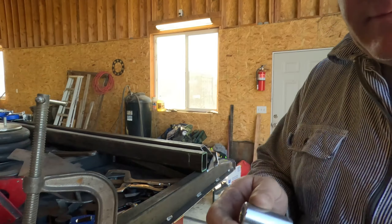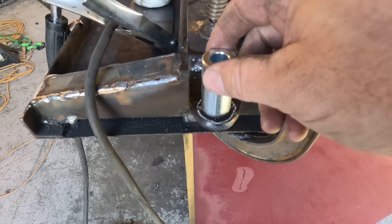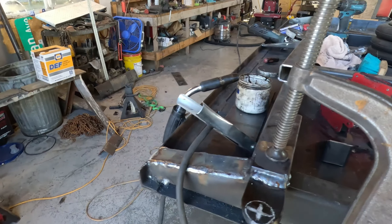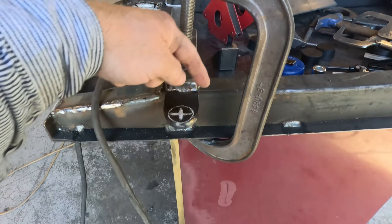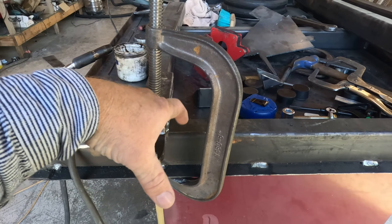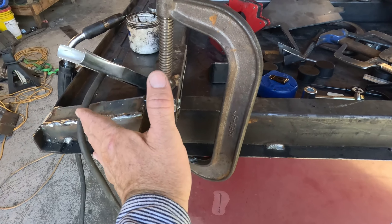This is kind of an ever-evolving thing — I change it as I go, trying to think of better ways to make it work. What I'm going to do is take this bushing, cut this end, and weld the bushing in there centered. Then I can make it greasable. I'm going to make the foot bigger — I was going to use that angle iron but I want it bigger. It'll pivot on here, and I need it big enough that it can't fold under as it comes up. I want it to actually sit on the floor flat and stay flat as this pivots.